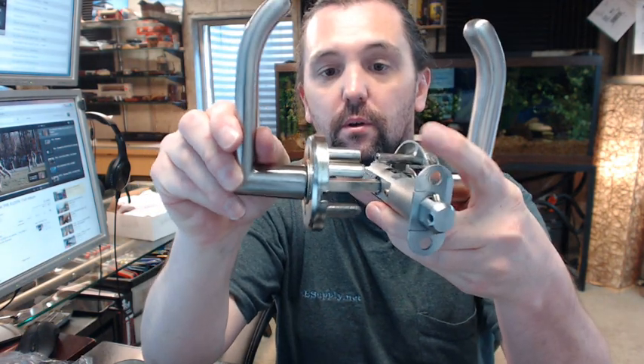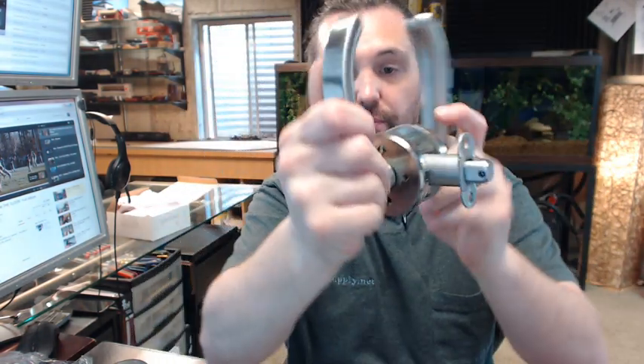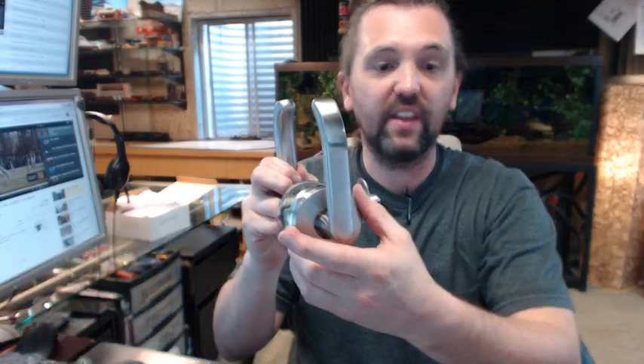Now from the interior — your perspective is from the inside. Those posts telescope like that as you can see. Now you are on the inside — this will always retract. If the privacy pin is engaged, to remove the guesswork I'm going to insert the privacy pin here and push it in. So now the privacy pin is installed. What is not installed are the two rosettes — you would do that before you install the privacy pin. Those are just installed by carefully placing them over, and then they snap on and down. It is that simple.